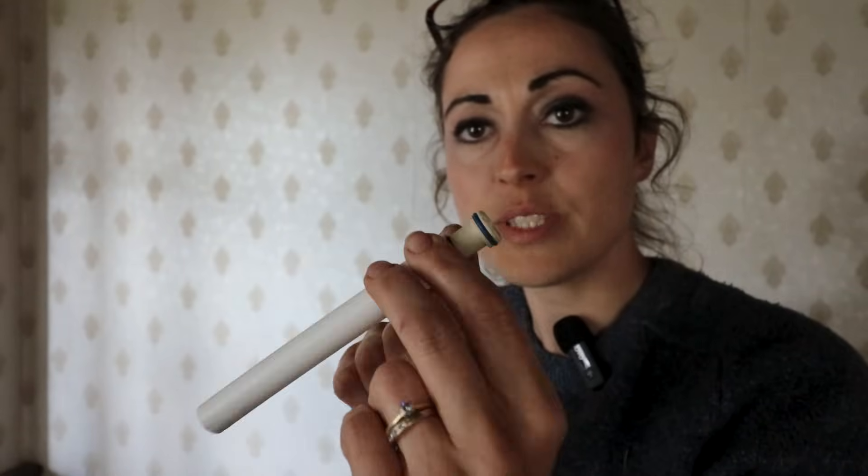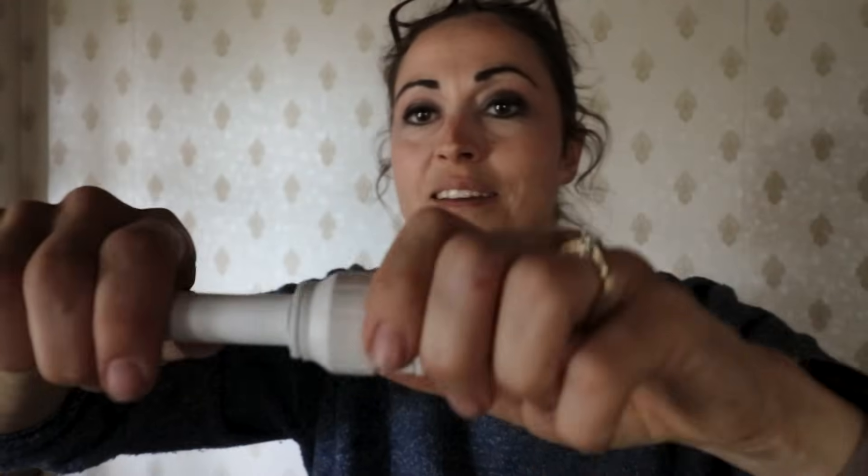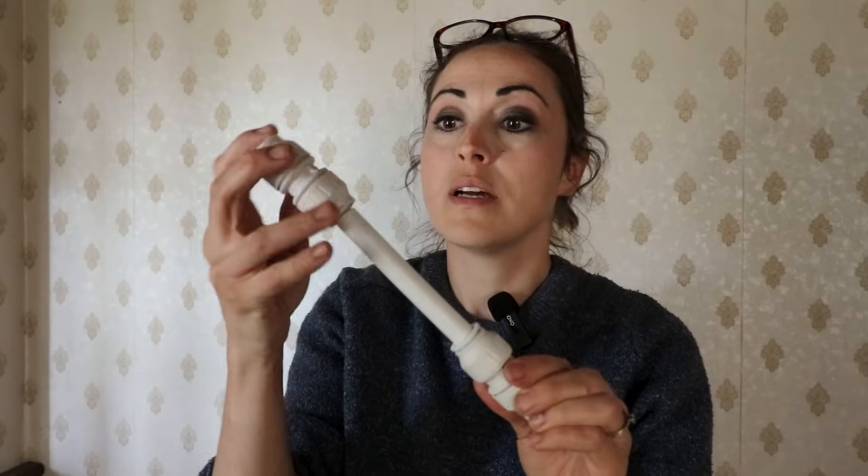To make sure it's going to be leak-proof I need to put an insert either end. It came off — and another one. Make sure these are unscrewed and push that right in, then tighten that one up. Another straight coupler on there — it's 15mm to 15mm — push as far as you can go and screw that tight.